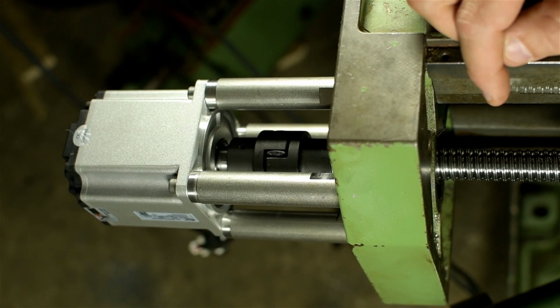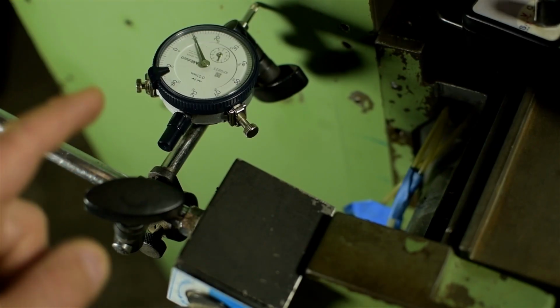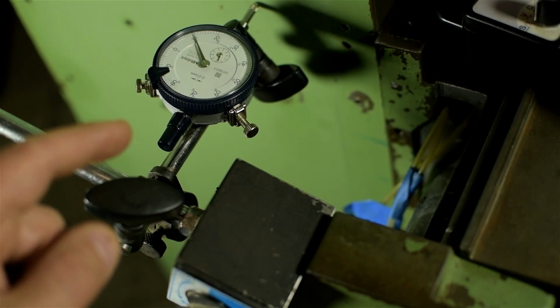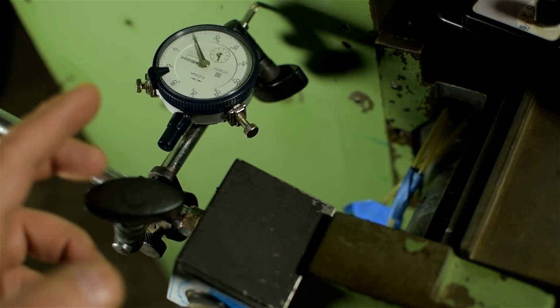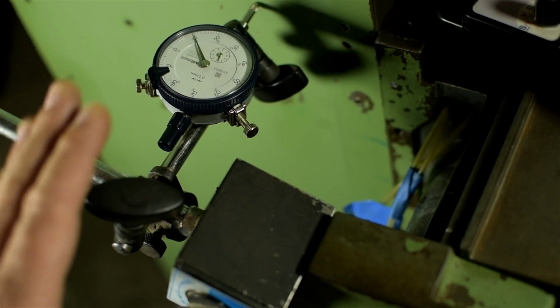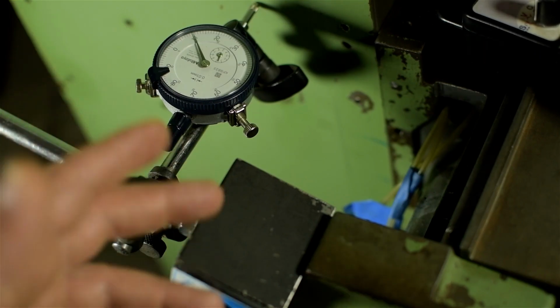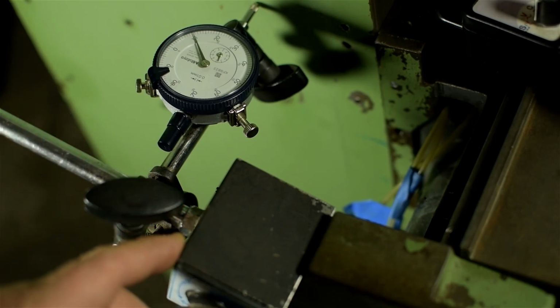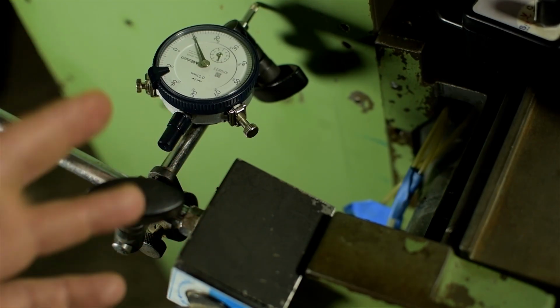Rookie mistake. I also think I noticed the indicator wasn't showing full 1 millimeter increments. Go back and watch that indicator face closely. You'll notice it lose, I think, 1/100th of a millimeter each turn. I haven't done a full axis calibration in Mach 4 yet, not to mention the mag base on the indicator is mounted a bit precarious. It could have shifted with the accelerations on each move.